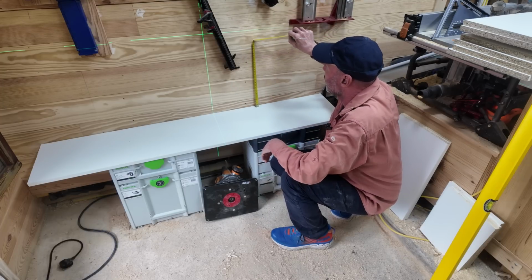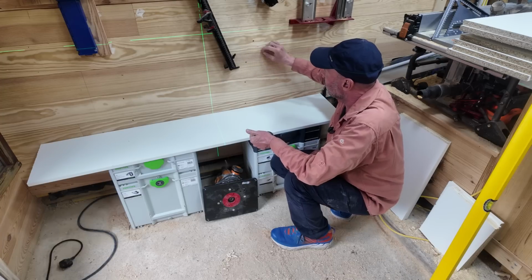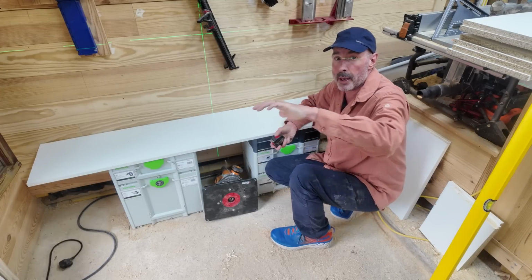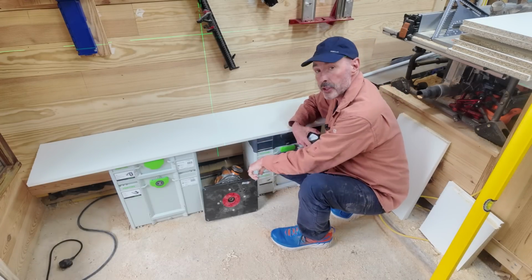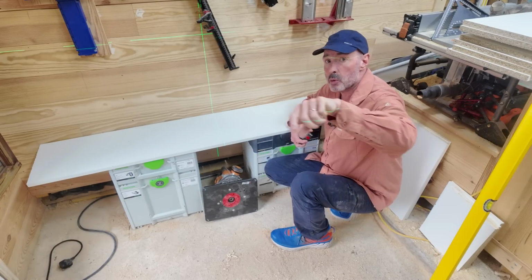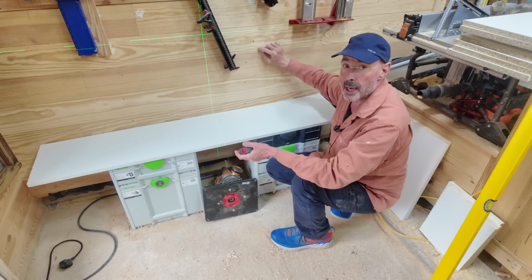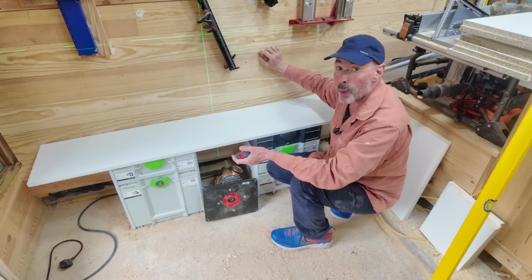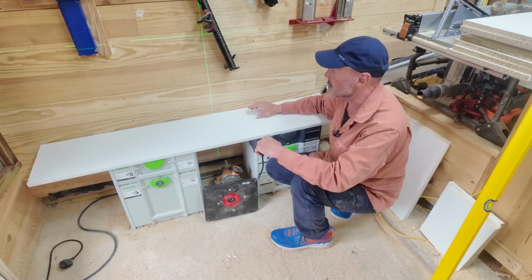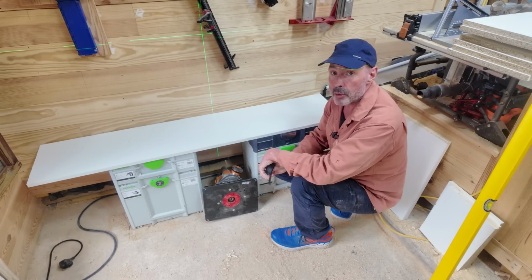I am thinking that I will build the top of the tower unit lower than this, so there'll be a top there. I'll need a frame to support it, and then this top, and the same here when I get this top coming out, 18mm is not thick enough for this router. I need 25mm. So really what I need is an 18mm sheet, nosing round, a little frame underneath which will help the hinging process. So I'm thinking I'll go this datum, less 18mm, less 20mm or 21mm for my frame. Surprise, surprise, parquet floor. And then this. I think I've got enough measurements now to build these 2 stacks. Then I'll have to go shopping for the rest of the materials.